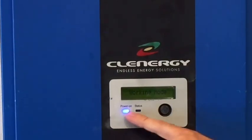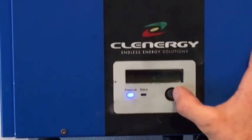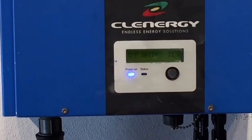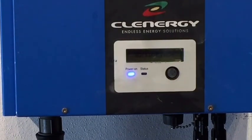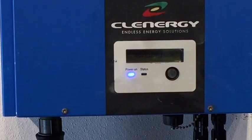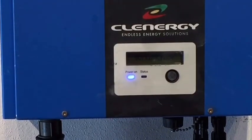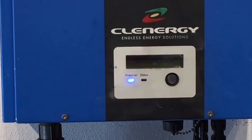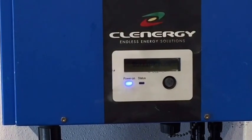The status light isn't on, which is usually a red light if there's a problem, but it says it's working — but it's actually not producing anything. Well, 12 watts, 11 watts, 0 watts, so it's pretty much producing very little. The solar panels this system is connected to is about 1.5 kilowatts worth, and at the moment it should be producing at least 1,000 watts. So this inverter actually has an issue which is causing it to produce a lot less power than it should.